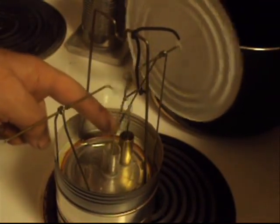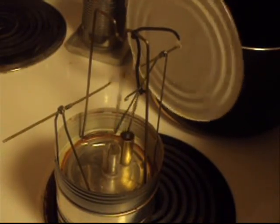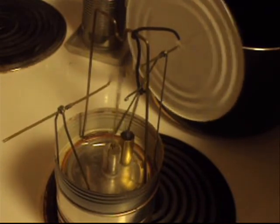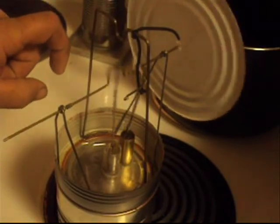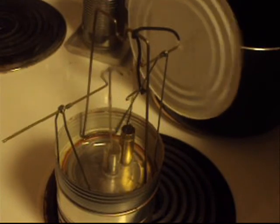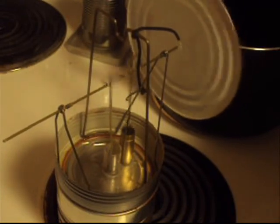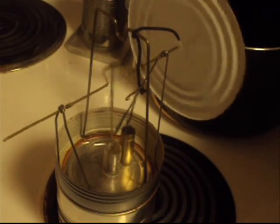The piston also needs to be a little wider. You figure 14 pounds of pressure inside and 14 pounds — I guess what you call vacuum — per square inch. The diameter of that is pretty close to about three quarters of an inch, or closer to a half inch worth of pressure on it. So I'm only getting about anywhere from seven to maybe 10 pounds of pressure on that piston up to the crank, and that's what it's running on.